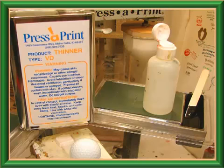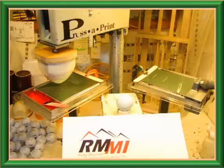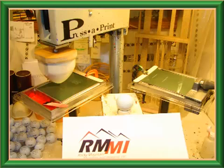It's a good idea to use chemical-resistant surgical gloves, and as the label on the can points out, have adequate ventilation. I'm working in my basement, so I have a kitchen venting hood overhead, and it takes the fumes out, no problem. Now, we need to align the ink wells and plates for perfect registration. It's fairly simple. Note from the client's logo here that the red print is under the black overprint. So we will print the red first.